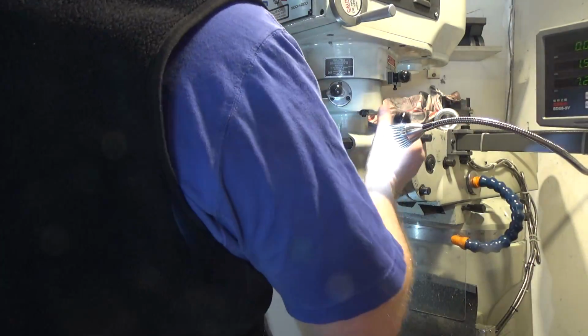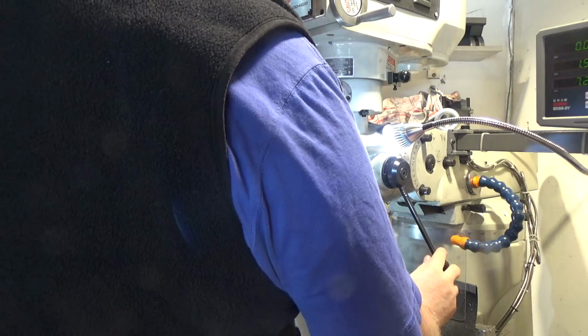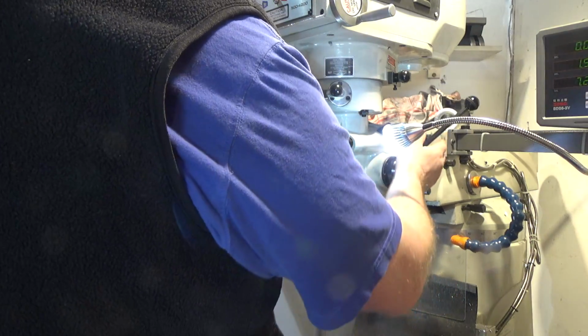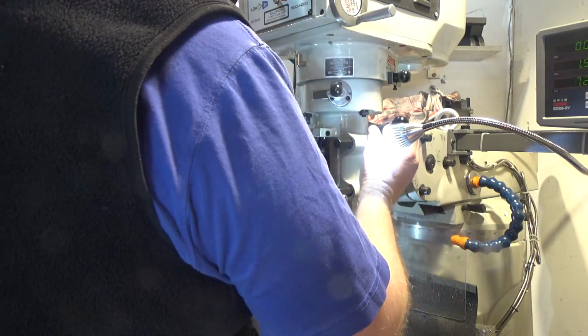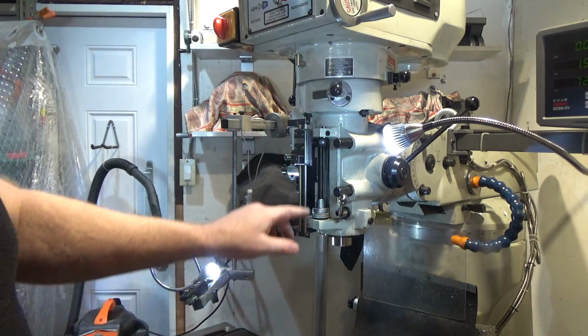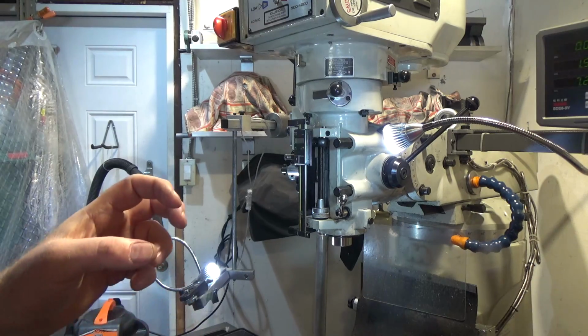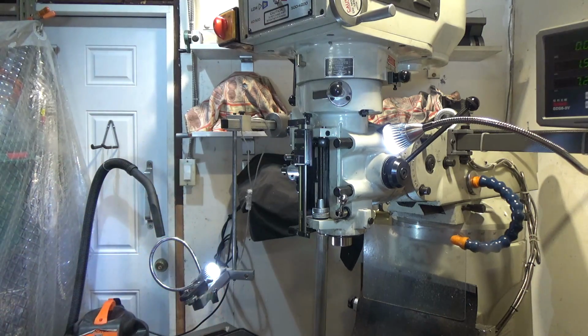All right, so we got the trip lever so it will stay locked and engage appropriately. And the reverse trip lever also is working. I have ordered the piece. I haven't replaced it yet. As soon as I get it, I'll put it in. I might order a spare. Apparently, they're pretty delicate. I could turn something like that on the lathe, but I need a form tool because they basically are ball bearings on a shaft kind of design.